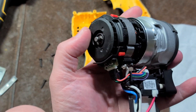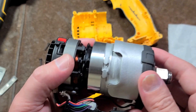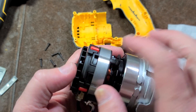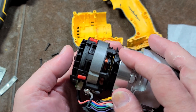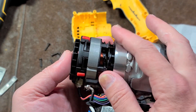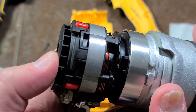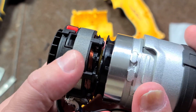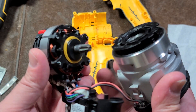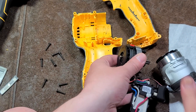And here's the entire impact wrench — really kind of surprising. In many cordless and corded tools, the centering of the rotating part of the motor — the armature — and the field is done by the case. When you pull them apart, usually the motor gets stuck against the side. But this is actually self-contained; the motor still runs freely. We actually have a seal there to help prevent leakage. This motor runs by itself — we could even plug in a battery.